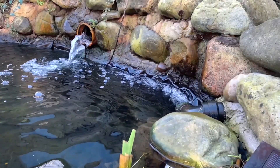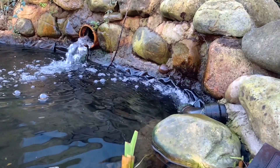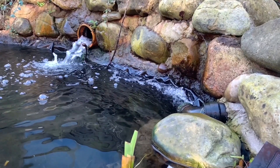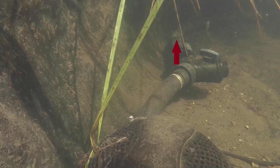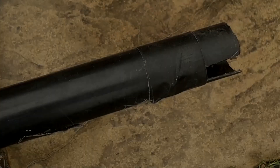Finally, in stage 3 of the moving bed build, I looked at increasing the flow through the filter. My filter is pump-fed through 1.5-inch pipe and returns the water also through 1.5-inch pipe. Water won't exit via gravity as fast as it enters via a pump, so to balance it, you need a larger diameter pipe work outlet than inlet. As my pump is not variable, I placed an old splitter after the pump in the pond so that I could adjust how much water was pumped to the filter. In stage 2, I replaced the 1.5-inch outlet pipe work with 2-inch. After giving the moving bed a week or more, I then increased the flow to the filter using a handy tool I made that prevents me having to get into the pond — it fits neatly over the tap on the splitter and allows some reasonably accurate adjustment.